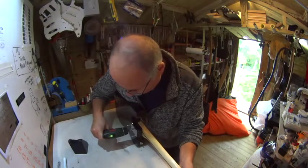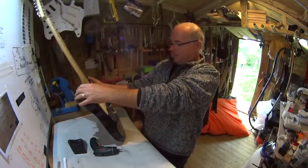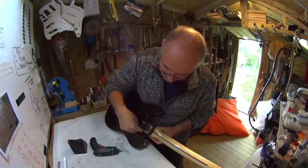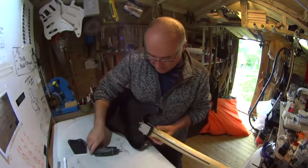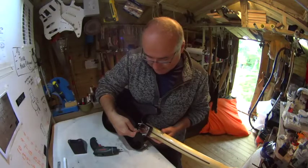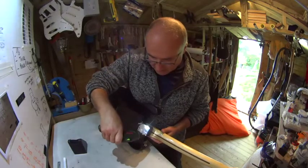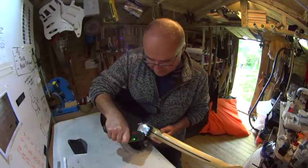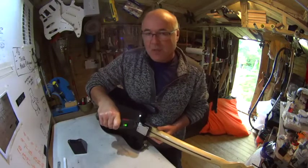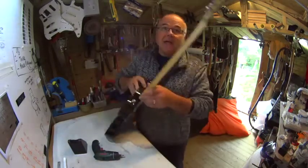Right, let's just have a look at this one. Let's see if we... Yeah, that's about as good as it's going to get. Yeah, I'll go with that. Like I say, if there's a bit more room that way, then you get that adjustment room. If it's dead flush there, you can't really press much more. You could kick out the end there just slightly, which is kind of what I'm trying to do a bit, but you could start with that screw. But this is so close, this one, I'm not gonna jump screws. Put a little shim in one corner just to ensure that it doesn't pull back in. But if we can do it without a shim, I prefer to do that.